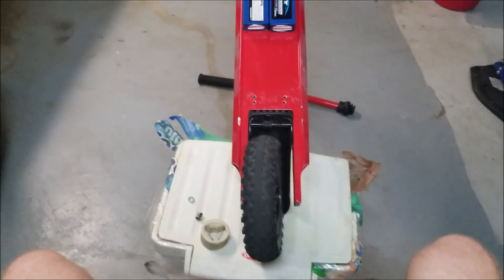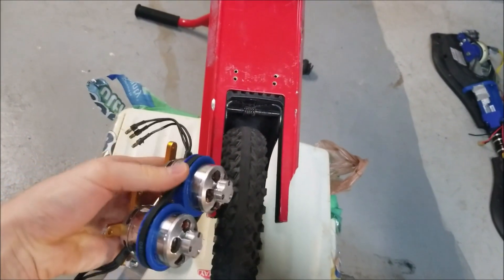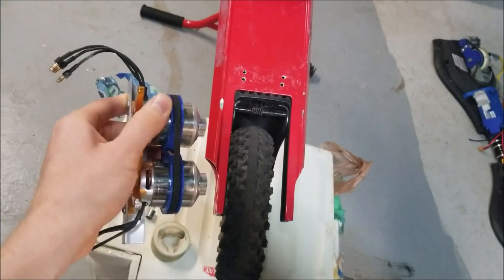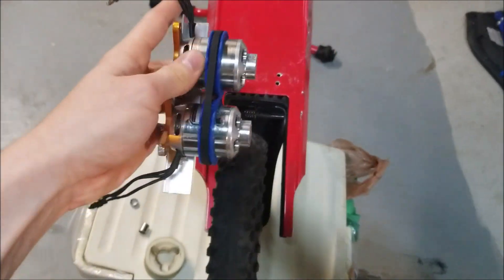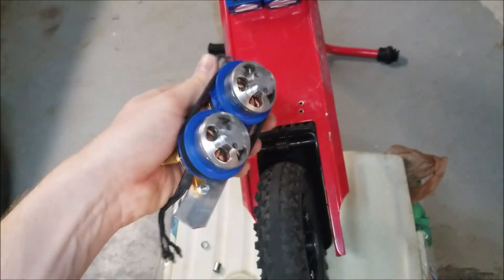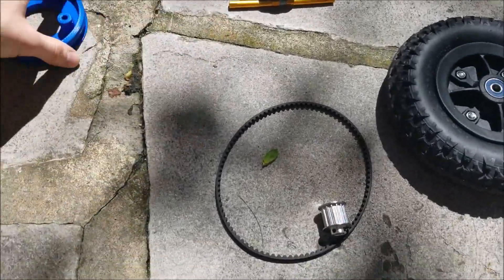Here's the plan — I've already done a little bit of work on it. I'm going to combine two motors, because I still want to use two motors but it didn't really make sense to keep them in the old format. I 3D printed some pulleys, put them around the motor cans, and this belt keeps the motors not only in sync but once I glue the pulleys it will combine the power output so they'll both be working together.